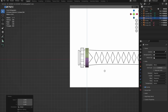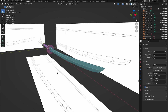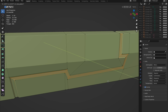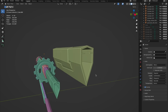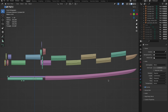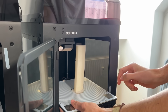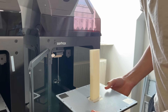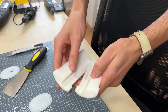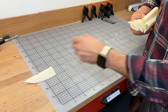He basically used simple geometric shapes to block out the base first and then added the details on top. If you're interested in this process, just check out his Blender tutorials on our channel. After he was done, he hollowed out the sword just like in our test, sliced it into several smaller pieces and sent them all over to our both 3D printers. Everything was printed at 0.19mm layer height and 2mm wall thickness in white ABS. Printing all slices took around 2 days in total - the blade alone was 7 individual slices.